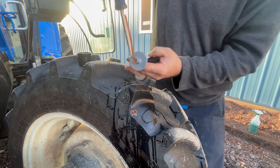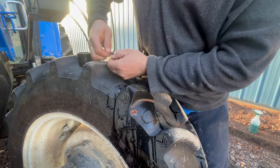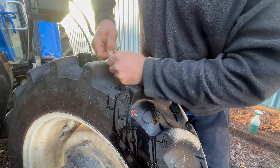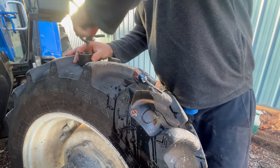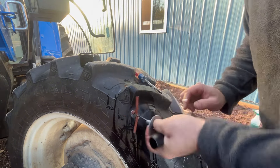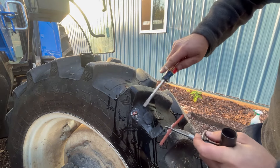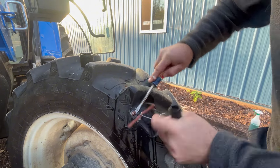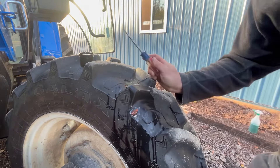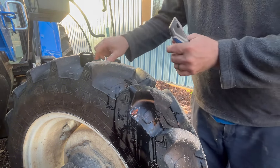What I did is get a flat tip screwdriver and spread that little clip so I get the tire plug in there a little bit easier this time. Same thing — 50-50 it. Put some lube on it. I'm going to try to get this in beside there without pushing the other plug in. Let's push the other plug in there. Perfect — pull it off quick. The trick to this, once you've got all this stuff out, is to air up the tire.